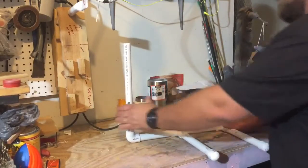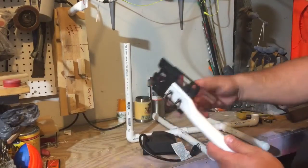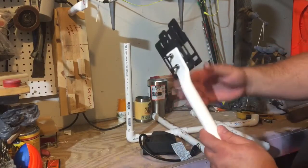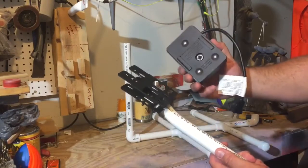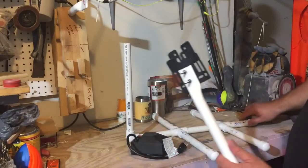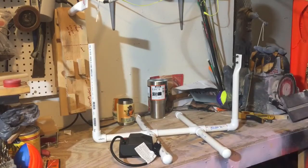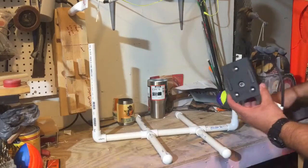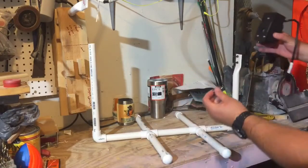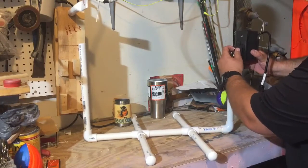So let's add that on. Next, we're going to add the motor and the motor mount. For the motor mount, I have flattened a piece of PVC — I've got another video on how to do that, you all can check that out. Drilled a couple of holes and mounted the motor mount here. So if you've got a Char-Broil, this is what yours looks like and everything will look familiar. If you don't, you might have to come up with something a little bit different. This is going to get mounted on the right-hand side. When the motor goes on, you're going to have this piece with your rotisserie. This goes into the motor, and the whole thing gets slid into the mount.